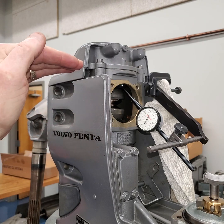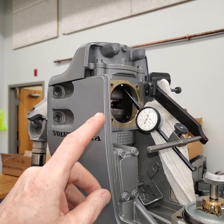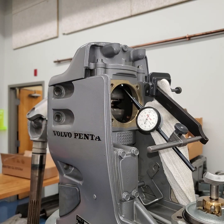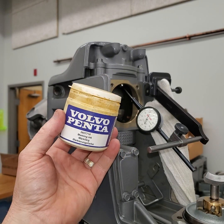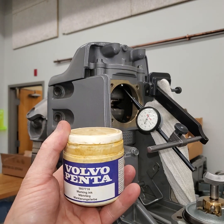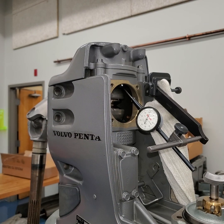If you take your time and measure everything, a lot of times when you put it back together it comes out right on the money. The only thing left to do is paint the gear teeth — three teeth on the lower gear — with marking compound. Volvo Penta uses this stuff, which works well. It's a yellow powder; I mix it with a little bit of oil — you could use gear lube but I just use regular motor oil — a couple drops to get a nice thick paste, then paint it on the gear teeth. As long as you don't use too much it doesn't make a mess, and they say you can leave it in the gear case. Gear lash is correct; the last thing to do is check the gear pattern, and if it's in range this drive is ready to go back into service.